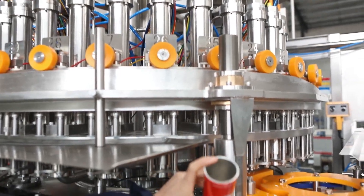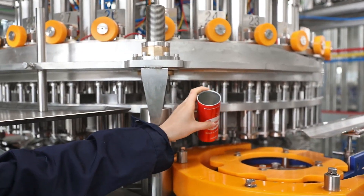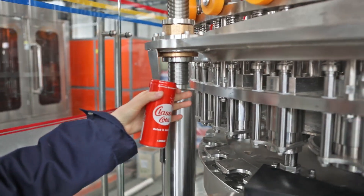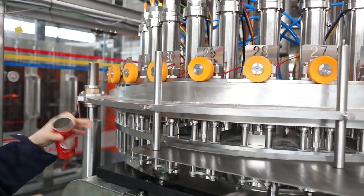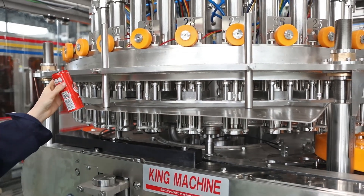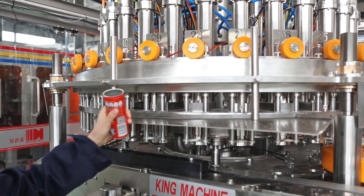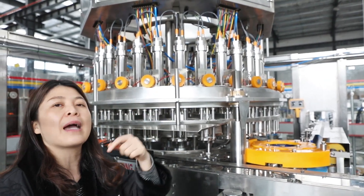The sequence is: fill CO2 inside the can first, then fill the beverage inside the can. No can, no filling. After that, CO2 exhausts slowly, then CO2 exhausts quickly. Then a cylinder refills the beverage inside the measuring cylinder again. The entire procedure — filling the beverage into the measuring cylinder — is controlled by timing, and the working time is very accurately controlled by the PLC.